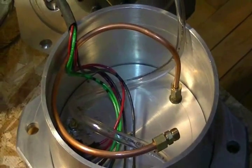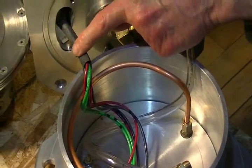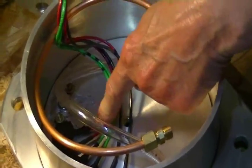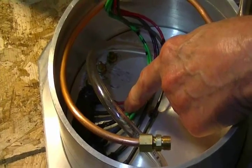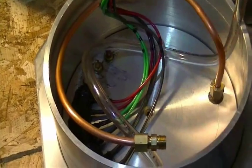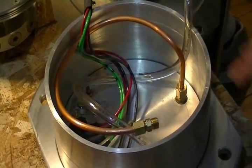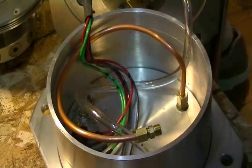You can see six wires coming down from the alternator stator. They're color coded — two blacks, two greens, two reds — paired off for the three coil sections. This is a three-phase system and we've separated each of the coil sections, so you can work with the coils independently or wire them any way you want on the outside — all in parallel, in series, or independently — depending on how you want the electrical signals to work for you.